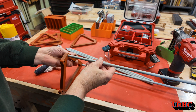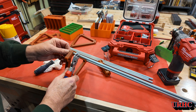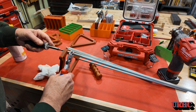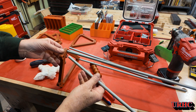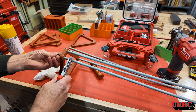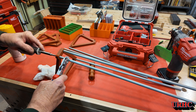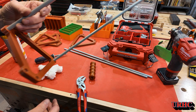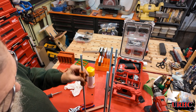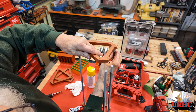Now it's time to start assembly. They just go into that pocket there, and I had these little truss head screws I had laying around that I'm going to use. You've got to be careful - you've got to make sure you get it tight enough that it won't strip out and loose enough that it won't crack the fiberglass on the end. Do some test pieces until you get the proper size hole for the screw you're using. Basically it's just five screws in from each end to hold everything together. Those pliers have smooth jaws so they won't scratch anything. Having those black screws laying around worked out good - I didn't have to buy anything. Now slip that handle on and do the other side.